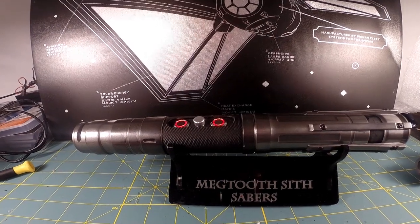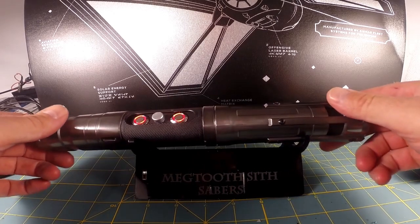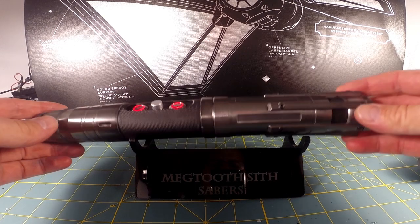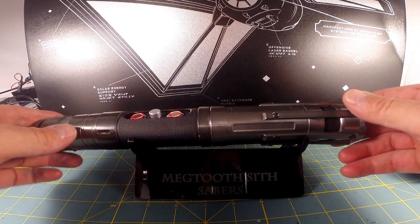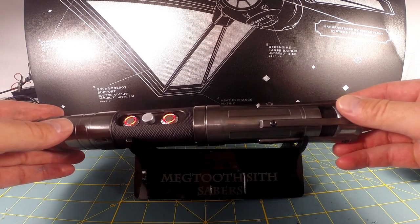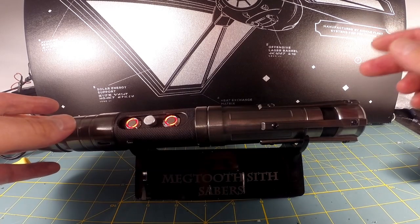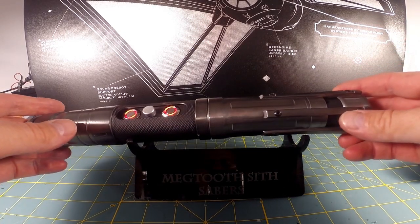And KSith, just so that you know, when you take the SD card out, don't change any of the folder names. If you have a new font you want to test, you just put it in one of the folders that I already have on your SD card. And as long as you put it in one of the folders that I have on the SD card, your new font will play in whatever presets that folder plays in.